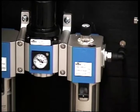And actually on our demo panel, I did put a lubricator in there, but in our case, because it's inside the studio here, I didn't put any oil in there. And as often as we're cycling it, it doesn't really call for oil. One key point we didn't mention, Tom brought up a while ago, is you can actually refill the oil while it's still pressurized. Yeah. You don't have to turn everything off. You don't have to have downtime for maintenance.